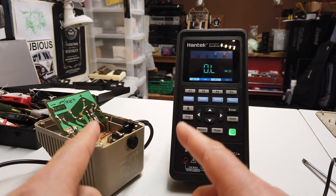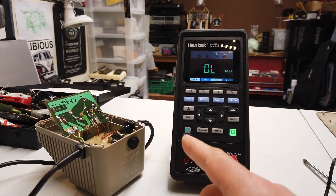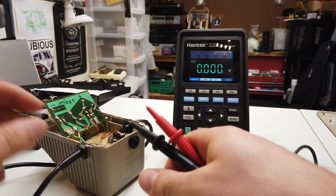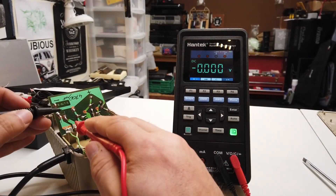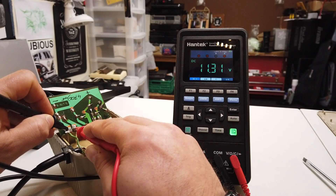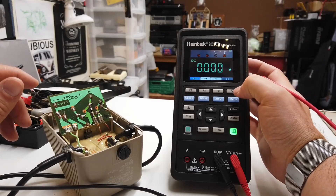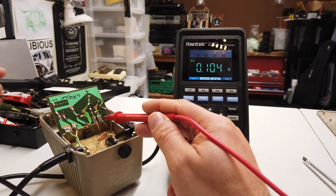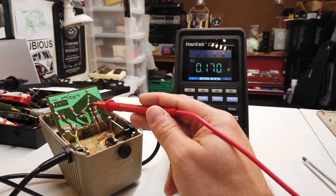We're going to be operating on live equipment. If you're not trained in that, get some training before you do this or just don't bother. It's plugged in, so let's look at DC voltage first. We're expecting one of these pins to offer up a five-volt regulated supply. What do we have? 11.3 volts DC. Interesting. The output of the transformer going into the regulator PCB is giving us 10 volts AC into the DC regulator PCB.